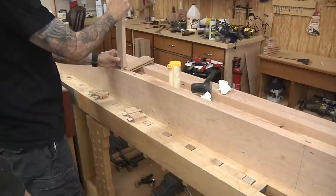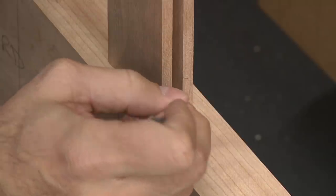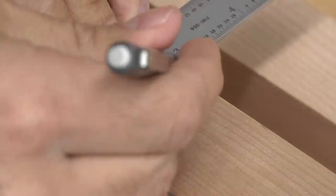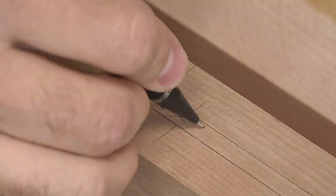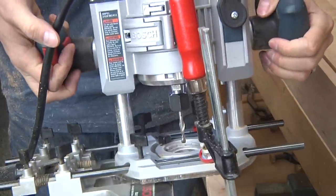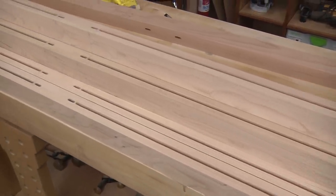Now let's do a quick dry assembly. The partitions with grooves give us some vital information about the stopped grooves that we need to cut in our rails, so I use a fine pencil to mark the groove locations. Since the pencil can't really reach all the way into that groove, I draw the full half-inch depth after disassembling the parts. I'll use a quarter-inch spiral bit in the router and an edge guide to make our grooves. I also attach a piece of scrap to act as a second fence to help me better balance the router. It's slow work, but if you push that bit too hard it's gonna break. As you can see, the grooves all stop before hitting the mortises.